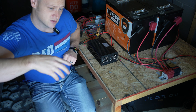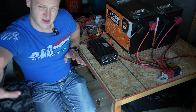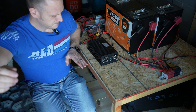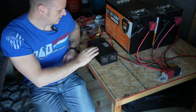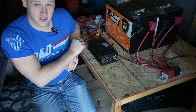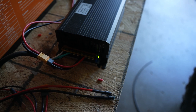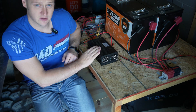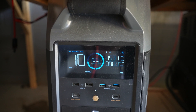Some of you asked why I didn't use a different power supply — the 16-amp, 90-volt one. Well, I could have, and you can as well, but I'll tell you a little secret: you can adjust the voltage out of these. There's a little screw by the input, and it increases the voltage out, which means practically this little one can essentially tap out the 1,600 watts of the Delta Pro. I'll show it to you in a second.